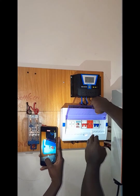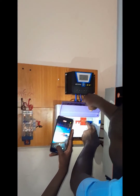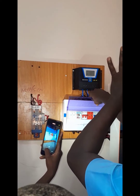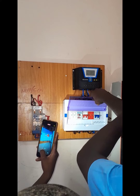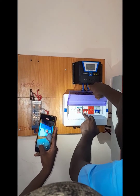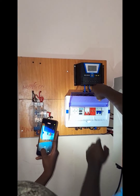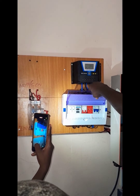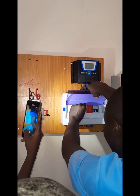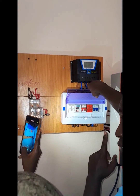On the protective circuit we have two breakers: one AC breaker and one DC breaker. The DC breaker breaks between the solar panel and the charge controller. Beside that breaker we put what we call a DC surge protector, so in case of a thunder strike, excess voltage or excess current, the surge protector will protect the system. It's green now — I informed them that the moment it turns red it means the surge protector is bad.